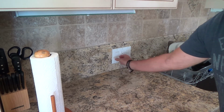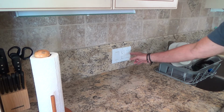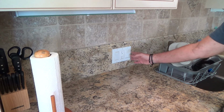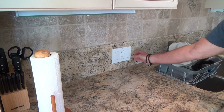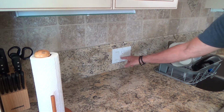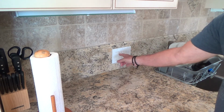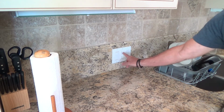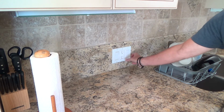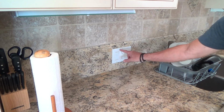It has a motor in it, and usually you don't hook up your garbage disposal with all of your light switches in the house. This one is for a light switch, and what they've done is they've probably attached this light switch with lots of other lights in the kitchen, in the main room, and all that. And maybe the circuit is full, and this is a 1 horsepower or 3/4 horsepower motor that takes a little bit more power. And so generally they'll have this on a separate circuit. The electrical outlet is probably on a different circuit than the light switches. Usually you'll find in electrical panels, most of all the light switches are all hooked up together in certain areas on different breakers than the electrical outlets.